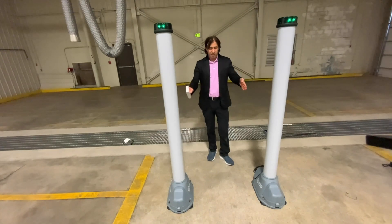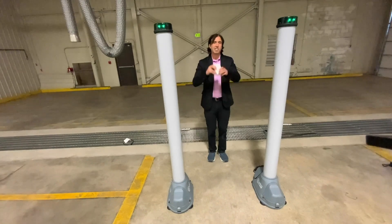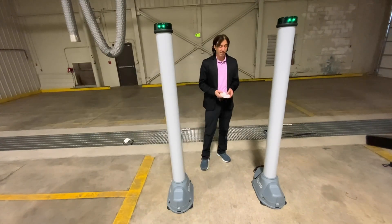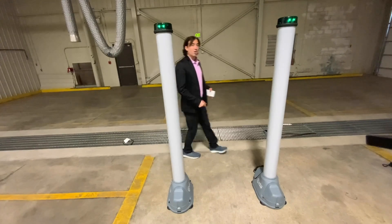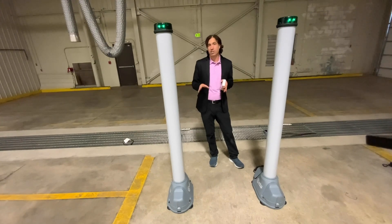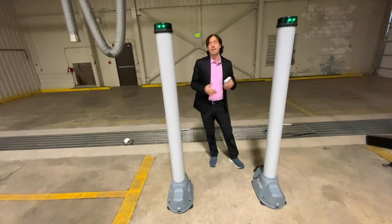By doing this, you're testing the size and the center. The center is usually the weakest point of all metal detectors, especially at mid-height. Every metal detector is different, so you want to test everything regardless of position or type. The standard does say it takes 66 hours to fully test a metal detector, but what I've shown you will tell you whether that metal detector is going to pass or not — and that's what you really need to know.